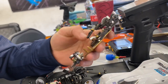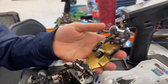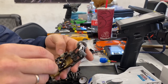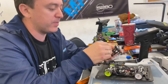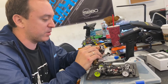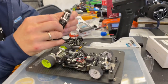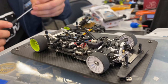This one-piece battery mount slash shock mount has two adjustment holes so you can adjust the angle and length of your shock. We also have our battery mounts for the O-ring mount all in one piece — it's lightweight and simple. The car is very modular: take these three screws out and you can remove the whole front end of the car. Take these two screws out and that comes off too. So much easier to work on. It's a very low parts count — it took me maybe three hours to build a prototype from scratch.